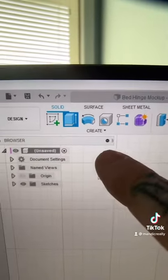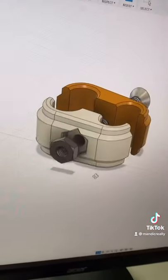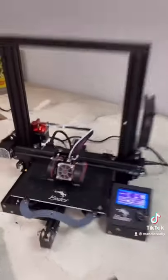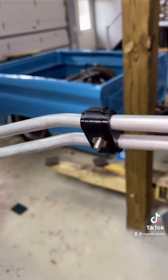With my rough sketch, I'll use the extrude function and extrude each half individually — that way I've got two separate pieces, which gives me this rough shape. Here's my finished design: it's got that raised stripe down it, a receiver for the nut, and a countersunk screw. Loaded up on the Ender 3 and currently printing in black PETG filament. Here is the final product off the printer and assembled on a set of lines.